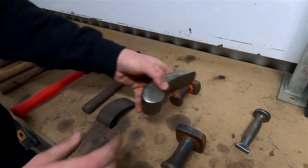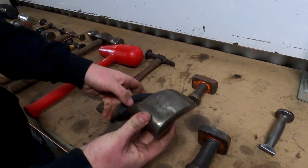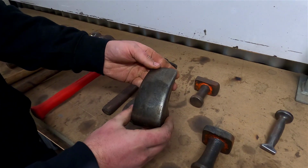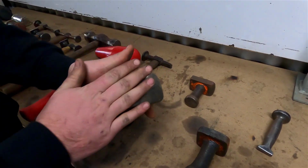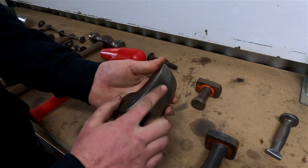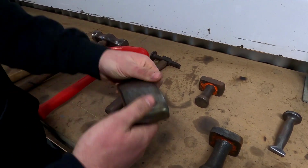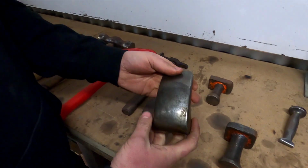Then you start looking at more expensive ones. While it's a similar shape and that sort of cursor look, this is another Sykes Pickavant dolly. This is a really nice finish on it. It's quite wide. It's also got slightly radiused edges on it, and you could pretty much use all the surface on this dolly. It's been really well looked after.